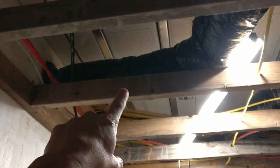I chose the insulated piping here. The reason I've chosen insulated piping is that I have unconditioned air, which could be either super cold or super hot. It could be really humid and it could be not humid, right? So you have a difference from outside to inside. You can get condensation on the piping, and there could be different problems that can occur from when you're bringing outside air into the unit before it gets there. And that is the reason I have insulated.